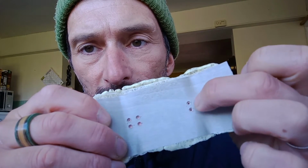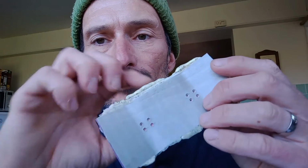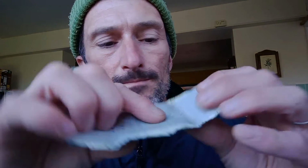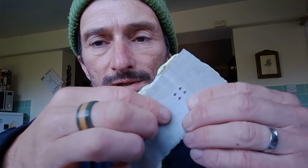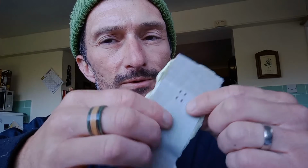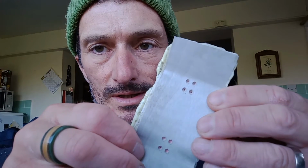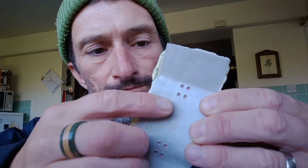All the little frayed bits on the top will get taken off when you actually sand the board. But as I say, I would normally do this after I've shaped it and started sanding it. I would do that once I get down to about 320 grit sandpaper, once I get into that fine sanding area. But just to show you guys, that's basically what I do on that.